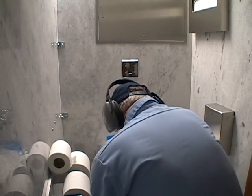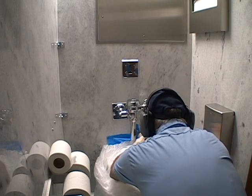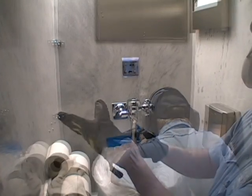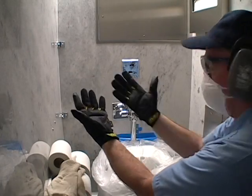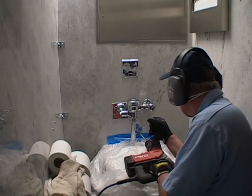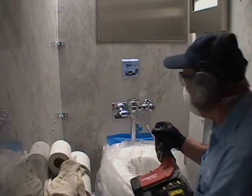When heavy vibration is a frequent part of your job, it can be detrimental to tendons, joints, and other soft tissues. In this example, an employee of the masonry division is drilling marble and employing a type of safety glove used for anti-shock. These anti-shock gloves are good for use with buffers, hammer drills, and jackhammers. Standard operating procedures will give the worker any pertinent information as to the durations of exposure, pressure limitations, and other job hazards.